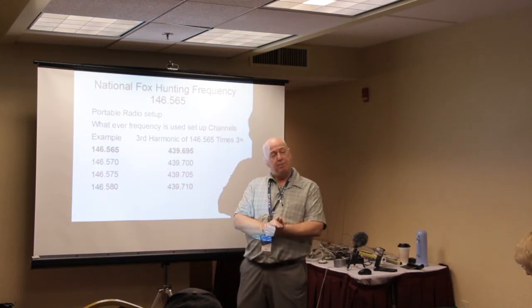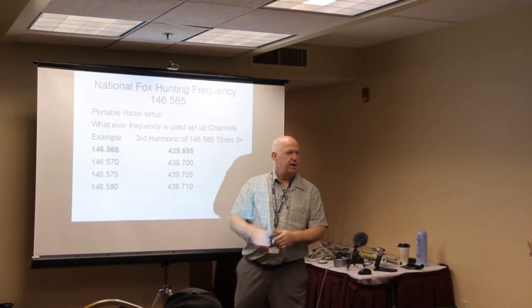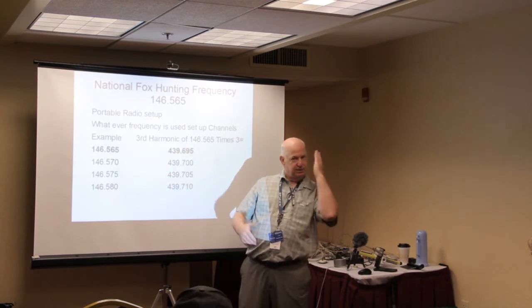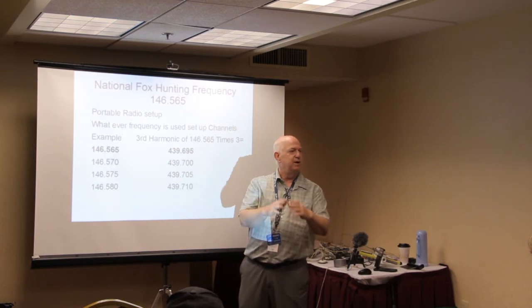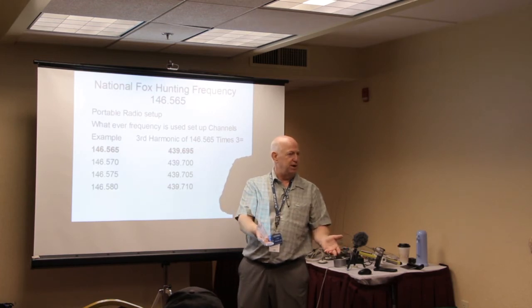It's good if you use the map and say, okay, it's that way, and you position the map and draw a pencil line. Go right or left of that signal, don't go towards it first, and find another signal and say, okay, it's that way. You draw that same line, and those lines will cross. It's going to be pretty close, unless it's a reflected signal off a building, a water tank, or something. That gives you a general area, and you can look and say, yep, there's conservation land there, and that's where I'm going to go. Or if you're looking for a signal where somebody has a stuck radio in their house, I think so-and-so lives down there, it must be coming from their house.